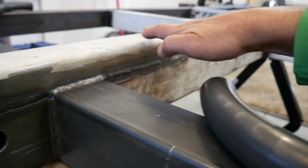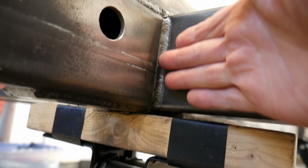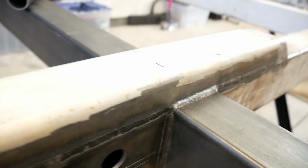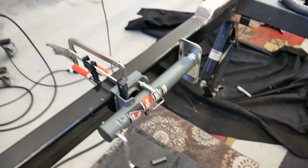And then if you look underneath, I also have a 3/16 plate that you can't see all the way back because of the jack, but it goes 6 inches past the weld seam, and then it goes another 6 inches back behind it. So rather than this entire piece just being supported off of these four welds going around it, it's now got this plate underneath it, and then it's got this piece up top, which really adds a lot of strength. Now that alone made this connection really strong, probably strong enough,